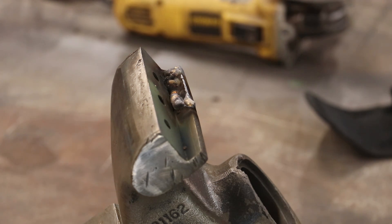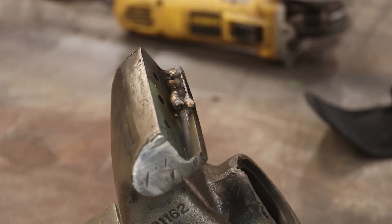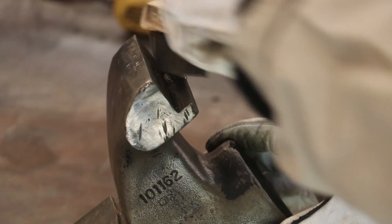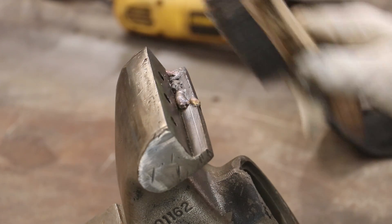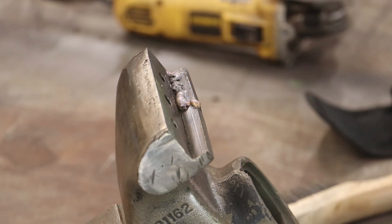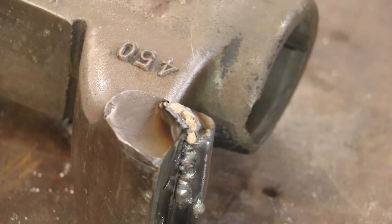We got a bead in there. It's not the prettiest I've ever done - it's kind of an awkward spot to be in - and I got some soot, which is mostly from the impurities in this cast iron. That's just cast iron brazing right there. Let's see if we can clean that up a little bit. I'm going to have to come in here and mill this out later on, but hopefully that at least got enough material down there in the bottom that it's going to close that up. I'm going to flip this over and we'll continue on working around. That went a lot better - it's not as hard to get into.